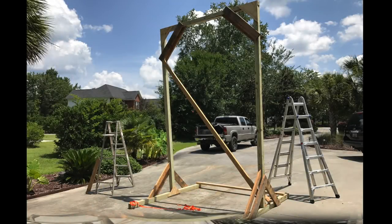This is what it looked like when I got it all put together. There was nothing really complicated about it — you just use four-by-fours for the upright members, a four-by-four on the top, and then some two-by-sixes and two-by-fours for the bracing. For fasteners I used 12d three-and-a-quarter inch nails hammered directly into the various pieces. I didn't get any pictures of me doing the actual construction; it was somewhere around 100 degrees outside and I was just trying to knock it out so I could get the drill press in my shop and find myself a beer.